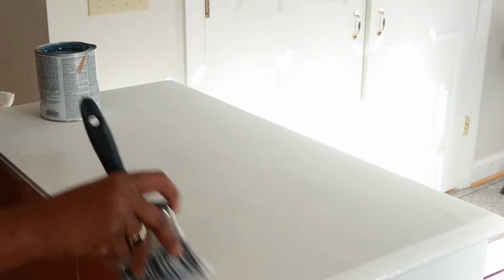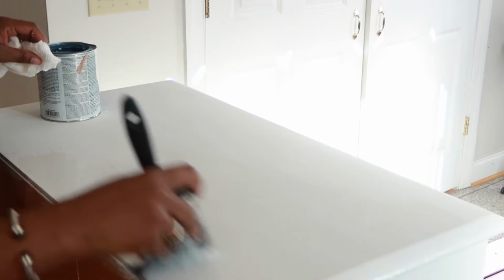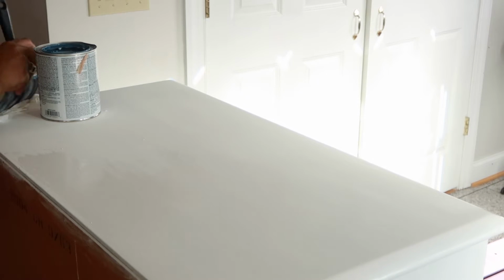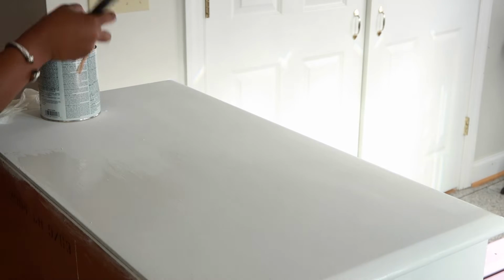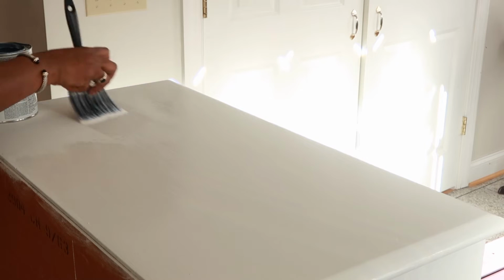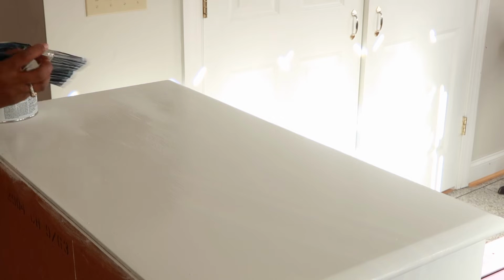As you can see, it has a slight milky look to it, but do not worry, it will dry absolutely clear and will not change the color of your piece whatsoever. You simply need a brush for applying the top coat onto the piece. Each coat dries very quickly, so you do not have to wait very long to complete the different coats. I applied 3 coats to give this piece the ultimate protection. I also applied the polyurethane to the dresser shelf and each drawer.